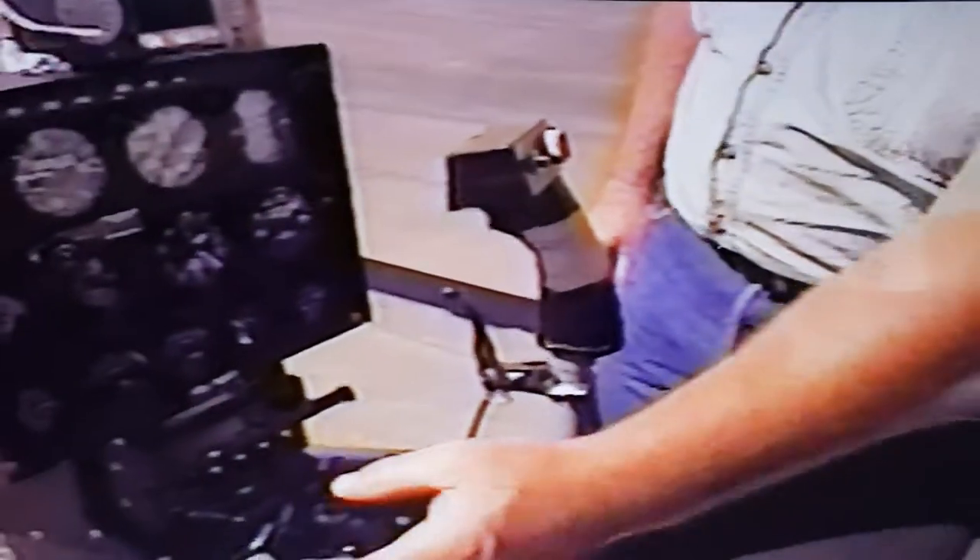When flying an experimental like this, it's good to keep your hands on the controls at all times. So controls for the starter and RPM are located on the end of the collective. You push the red button to bring RPMs up into the green on the instrument panel, then you can stop and forget about twisting the throttle. A thumb switch controls the landing light without taking your hand off. The throttle is right here and twists just like the Brantley — outward increases RPMs, inward decreases RPMs.